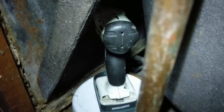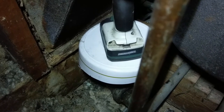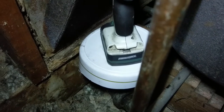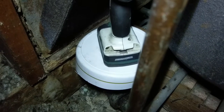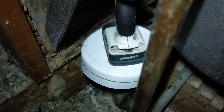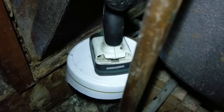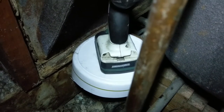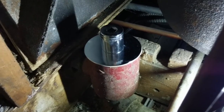I was able to get it unplugged using that little zip-it. There's a dish down there - I don't have video of the amount of stuff coming out but it was disgusting. The drum trap is clear and I was able to run water smoothly. The top is reusable but I don't have a seal for it - the original seal was who knows how old, so it was dead. I've rigged up a temporary solution to keep sewer gas out. I'm going to stop at Menards after work and grab a new top, taking the old top as a reference, and then we should be good to go.